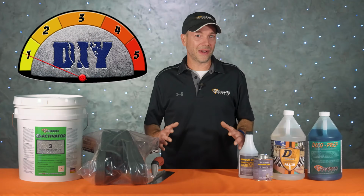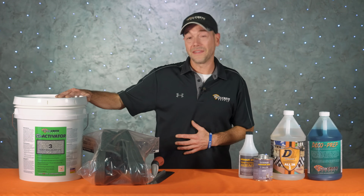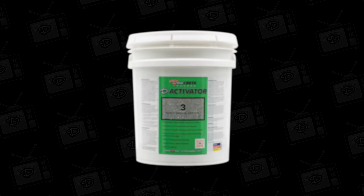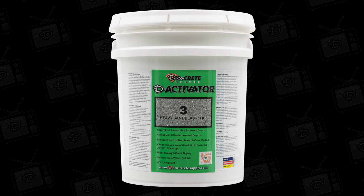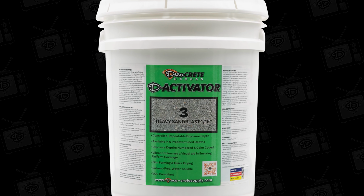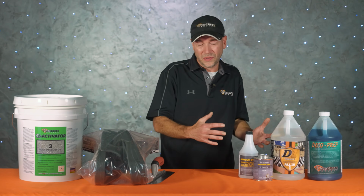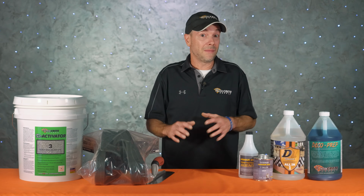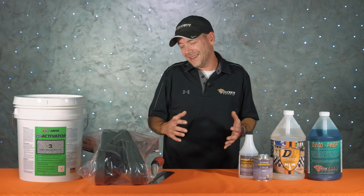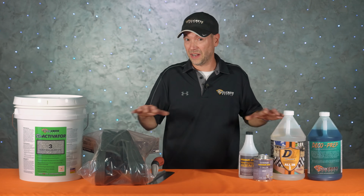So today's project rates as a 5 on our DIY meter, and the product we're going to be using is D-Activator from Deco-Crete. Now, D-Activator makes exposed aggregate concrete easier than ever because of its predetermined exposure depths. With traditional surface retarders, the depth of exposure completely relies on the timing of when you wash the surface off. Now, it can be a guessing game of how deep the exposure will be, and if you have a really large area, chances are slim that it's going to be consistent through the entire slab.